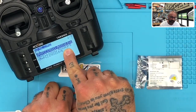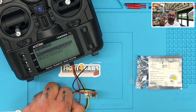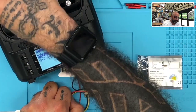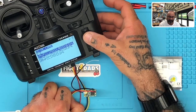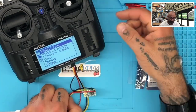Go to that folder, click enter. We're going to use the RSSI 16 version. I set up my radio with four channels for stick inputs, arm mode, and fail safe. Just do the XM Plus first one with RSSI 16. Hold that down for a second — it's going to say: do you want to flash S-port internal or external? This is the S-port, so click that. Now watch — you're going to see it start lighting up. See how the red light comes on.